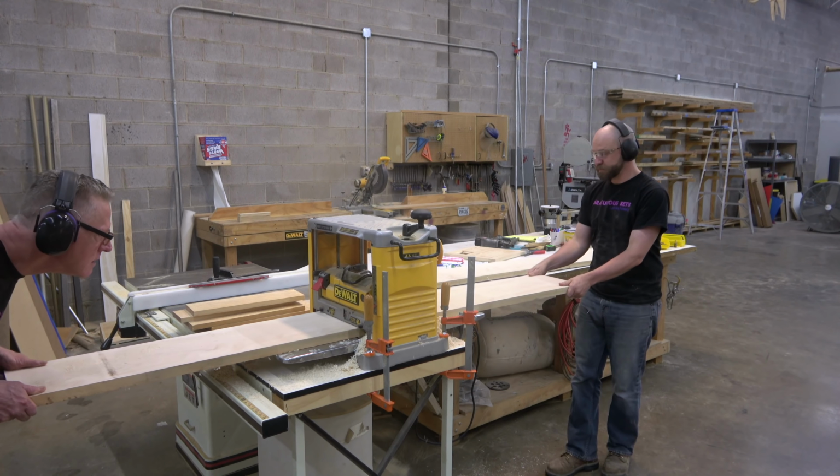On this one, I made the tabs the same length as the troughs are deep, and that just causes more friction. So I figured, playing with this one, if the tab is just a little bit longer than the trough is deep, then that takes your friction point down to 1/3 of what it would be if the whole joint were able to rub rather than just the front tab. I'm not sure if that makes any sense with this obscene hand gesture I'm making at you right now.